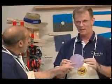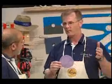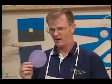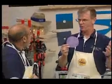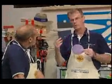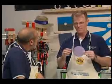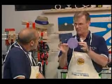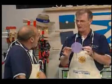And this is silicon carbide. Negative. This is an extremely refined aluminum oxide. Aluminum oxides are available from a very unrefined brownish crystal all the way to an extremely refined white powdery type crystal. And that's actually what goes on to this paper itself. Okay, and you're sure? I am sure. It's an extremely refined aluminum oxide.